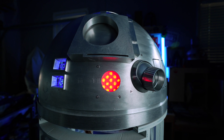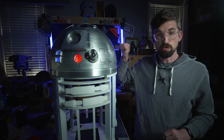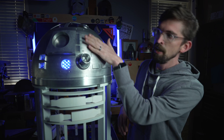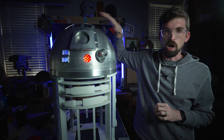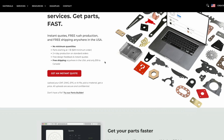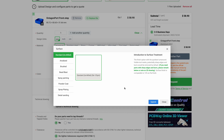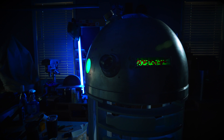While CNC, 3D printing, and lasers are great, there are several parts on this that are none of those — they're actually all aluminum. This is a special category unique to builds like R2-D2. A lot of people have built these in the past and actually do parts runs where you can buy pieces like this eyepiece or this holo projector, milled out of aluminum blocks. Even this dome is a big aluminum spun piece that's laser cut with a specialized laser. There are services now like SendCutSend or PCBWay where you can upload a file — an STL or OBJ — and determine how you want it made. I've done this a few times and got aluminum pieces made; these mounts were made by PCBWay. I uploaded my file, selected the material, and they sent me a part I just would not be able to produce myself.